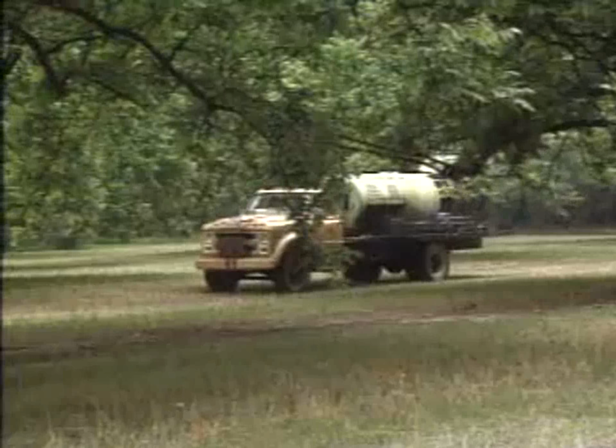Select 8 nozzles that meet the following qualifications. They have a combined output of 21.6 gallons per minute, and they can be arranged to provide the desired volume in the top and bottom half of trees.